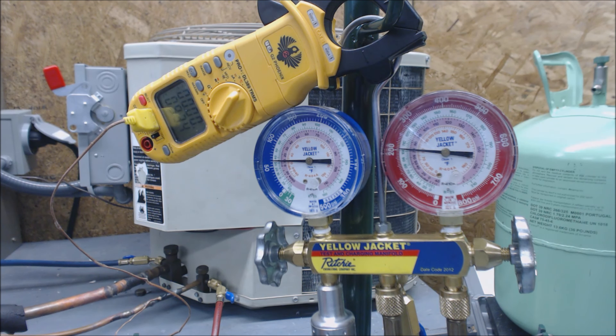So if it's 103 degrees at its saturated condition where vapor and liquid still exist, after it completely turns into a liquid from there until it comes out, it's decreased to 93 degrees roughly. So we have dropped 10 degrees in liquid form — that is subcooling. Subcooling is a temperature decrease in liquid form.